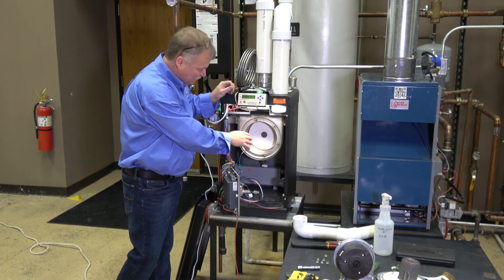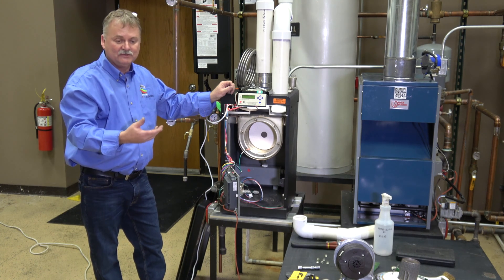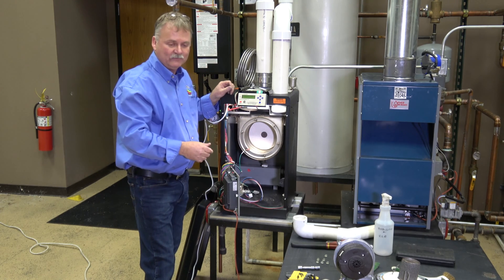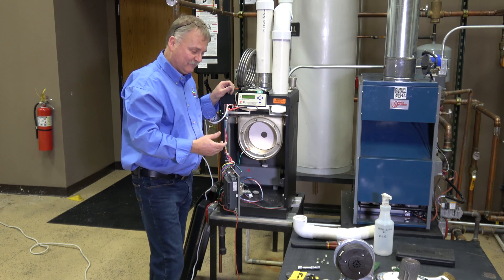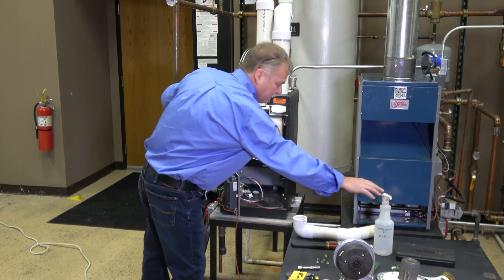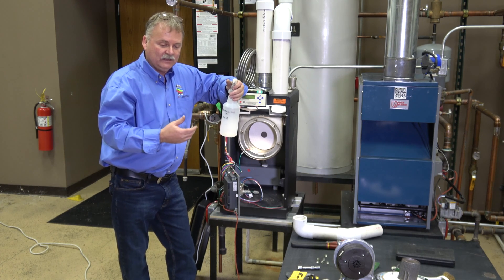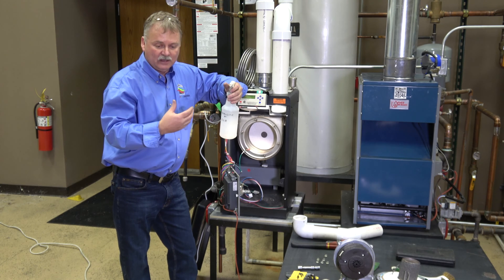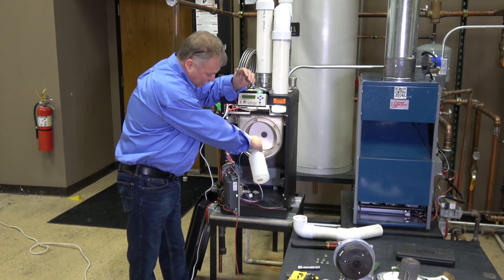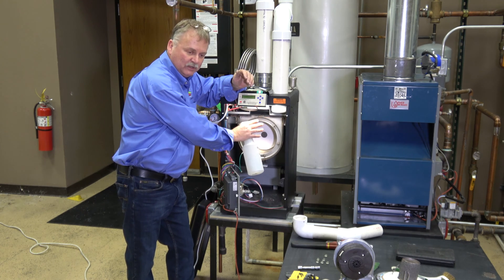In this application there's nothing here, but we want to cover that target wall. The easiest device to use is basically a paper plate — sounds simple, but it is simple. You want to cover that target wall up. They don't like moisture; they don't like water being sprayed on. So now we've got a paper plate back here covering that target wall. We take a good coil cleaner — we're looking for something that's going to get rid of the buildup of combustion and all the junk that's been getting sucked into this boiler. We're going to spray down all these coils and get them nice and wet.